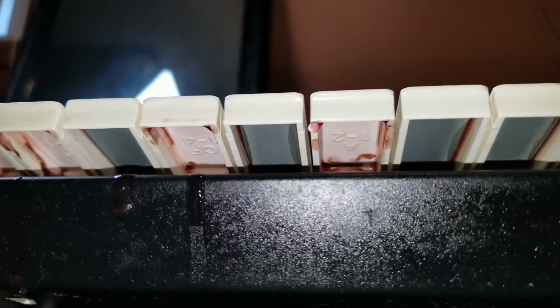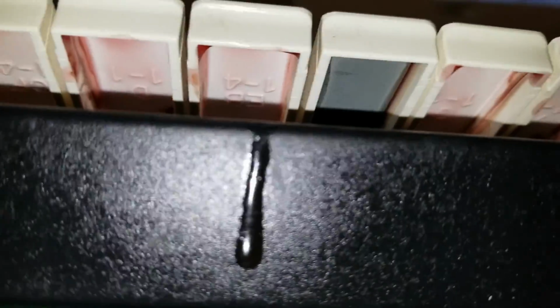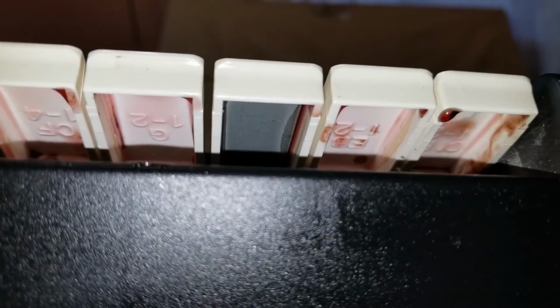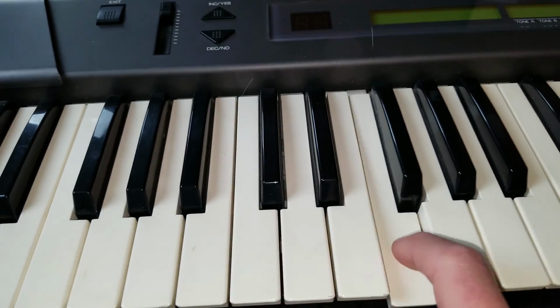One of the big problems with the JD-800 and other synths from Roland at the same time was this horrible epoxy they used to glue the weights in its semi-weighted keyboards. The epoxy glue failed, and when any heat occurred, it dripped out and got into the innards of the synthesizer. It was extremely sticky and gooey, and it destroyed a lot of synthesizers. Roland actually had a warranty where they would replace keyboards on these synthesizers for free. However, this one was never actually replaced.